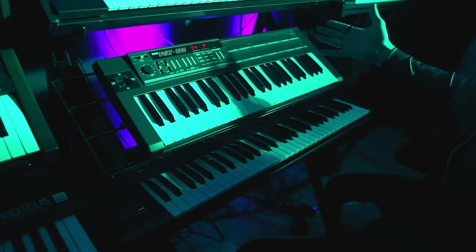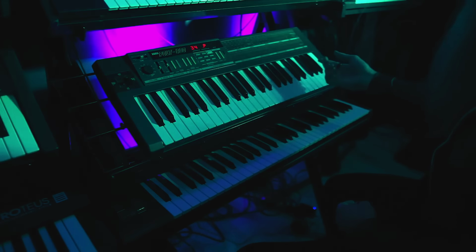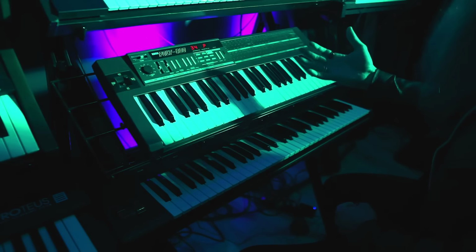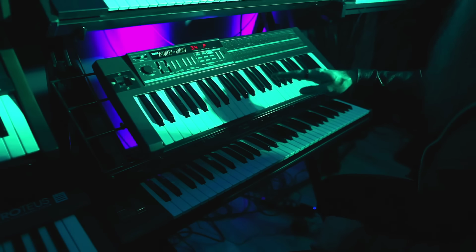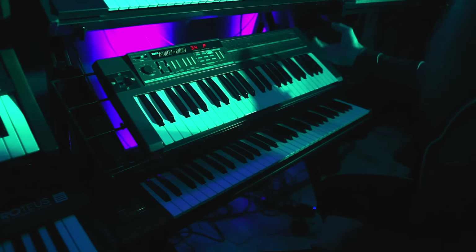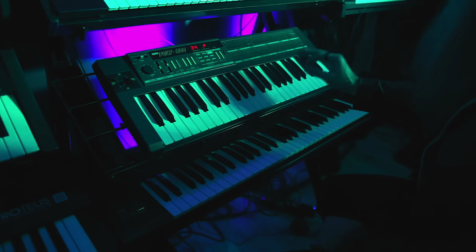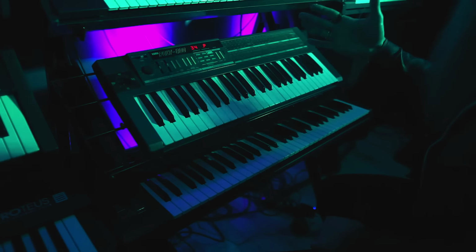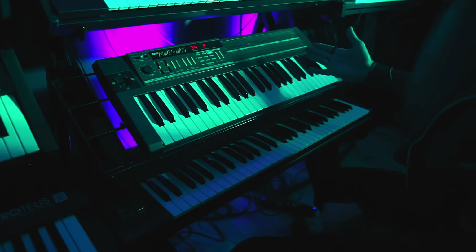The biggest factor that actually affects the sound of the synthesizer is that it has only one analog filter for the entire synthesizer instead of an analog filter per voice. So this is what we call a paraphonic synth as opposed to a fully polyphonic synth like the Korg Poly 6. Curiously, the Monopoly, which has only four oscillators as opposed to the eight in this synthesizer, is also paraphonic, meaning it only has one analog filter. And the Monopoly routinely sells for $1,000 more than the fully polyphonic Poly 6, which has six oscillators with six filters, one per oscillator, and a sub-oscillator per oscillator. Riddle me that. So what does that mean in terms of sound?